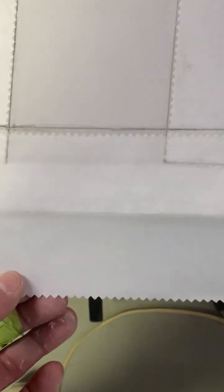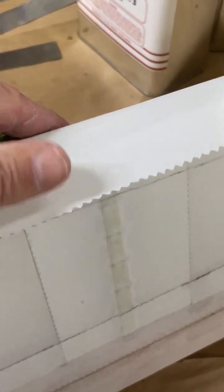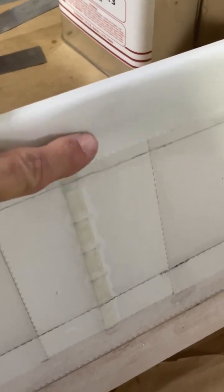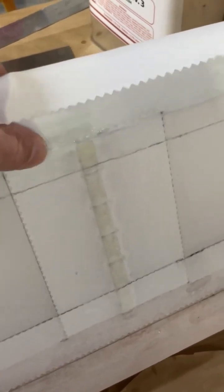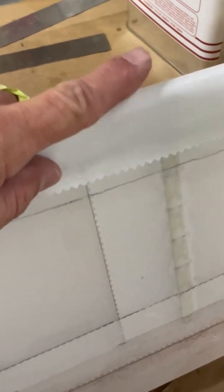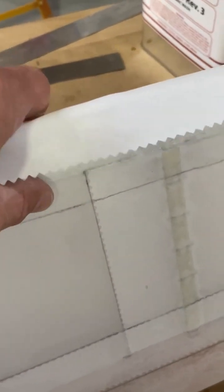This one I'm going to wrap a 4-inch. Now I'm going to try to do this with one hand to start out. The problem is when you try to wrap around, most people want to glue, and then they get a hold here and they wrap around here, and the first thing I want to do is start putting it down. They've already got their base glue, and in this situation I would probably go extra base. I might put 3 good bases down, and always remember to put a base on the trailing edge, that side, and on the end. You want a lot of base down to do what we're going to do here.